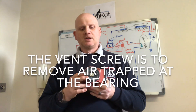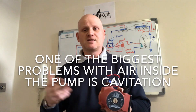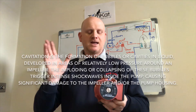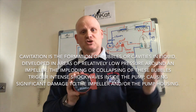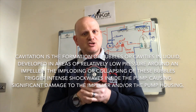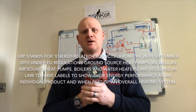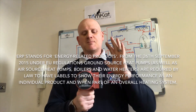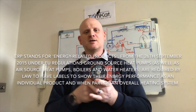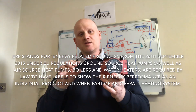On newer pumps, a lot of the time there is no vent screw. Since 2013 we've had to have ERP — Energy Related Products — rated pumps, so pumps must be able to turn their speed down automatically. In combi boilers and traditional systems — Y-plan, S-plan — you can still get energy pumps. The biggest problem with energy pumps is if you've got a microbore system on a combi that was piped incorrectly years ago, there might not be enough energy in the pump to reach the last radiator.